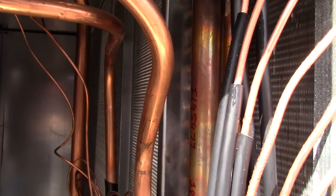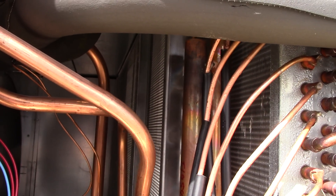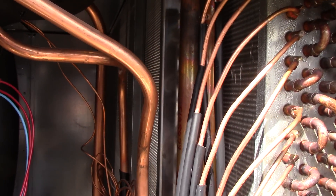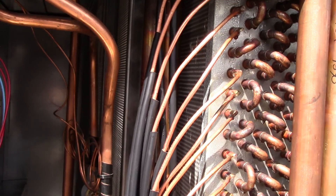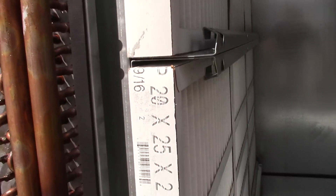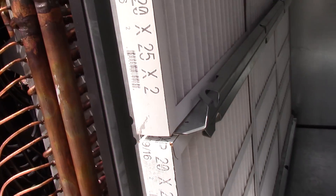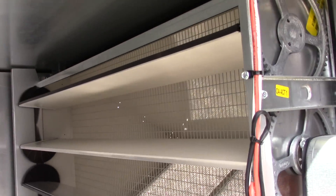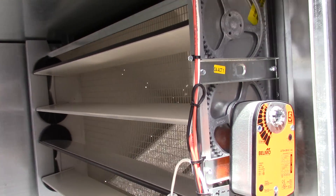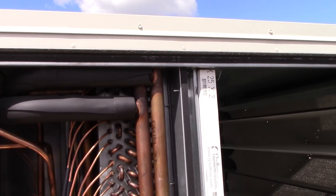There's another coil inside — my hand is touching it right here. This is a different coil from the evaporator; this is called the reheat coil. Whenever the temperature gets too low, it heats the air going back in to keep it around 70 degrees. It may swing down to 50 or up to 85, but it does its best to maintain setpoint. We've also got 20-by-25 air filters — six of them. Here's the economizer, which turns these vents on and off for 100 percent outside air.